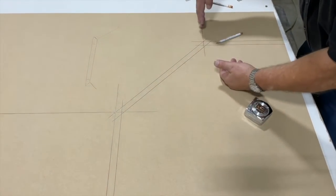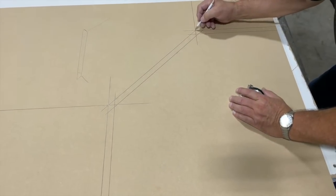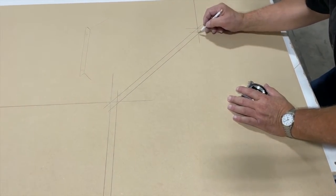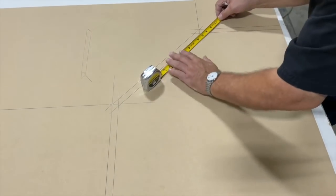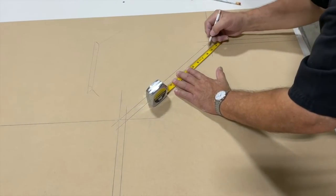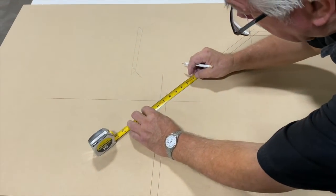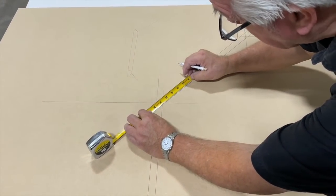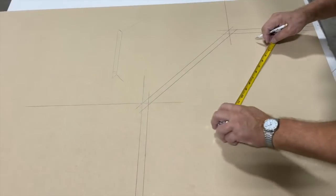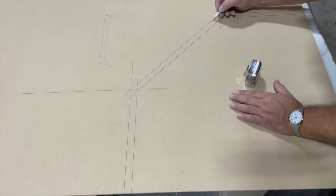If this was a base cabinet, there would be drawers that have to open, and they have to pass one another. And I have found that by having a frameless cabinet on either side, I need to have a 2 3/16 corner style on this cabinet in order to allow my doors and drawer faces to pass without bumping into one another. That's just a measurement that I have learned with experience over the years. It's a trial and error measurement that I have come up with.